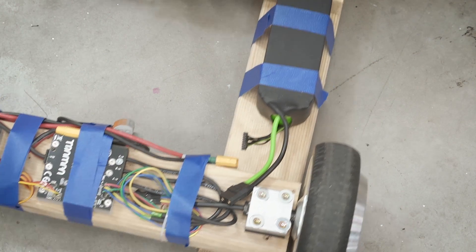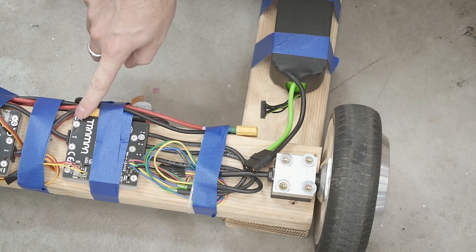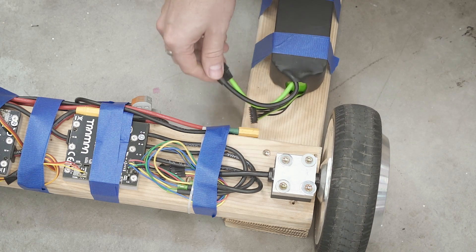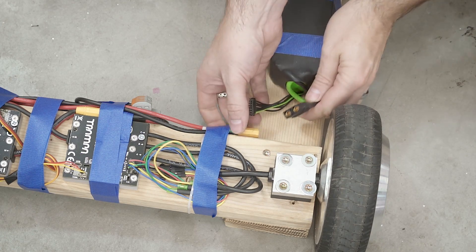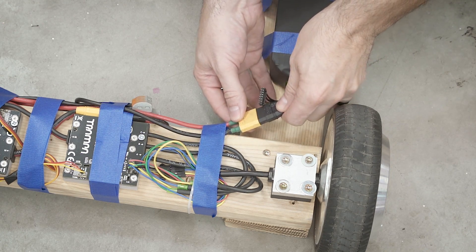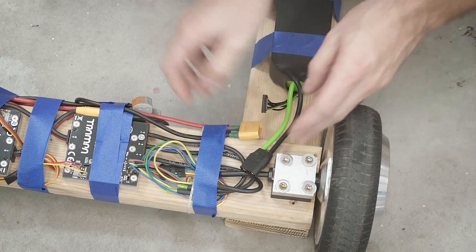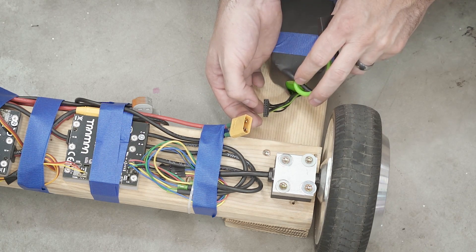Here's a little project I've been working on — just a little test setup to play with some hoverboard hub motors. I've got a Trampa ESC here, just this VESC. I have a nice big LiPo battery over here — a 5 amp hour 6S — and I have another one over there, so this system is running 12S right now. What's going to happen is I'm going to plug this in and you're probably going to see a spark or a pop. It doesn't always happen the exact same way. Oh, that is a good one! You probably saw a little bit of light even coming through the casing right there. What's happening is I'm plugging this battery in and all the electrons are just dumping into this whole thing instantly, creating this nice little pop. And that's what we're trying to avoid because over time it's going to wear out that connection point.